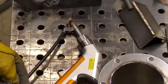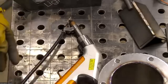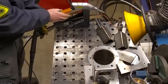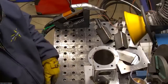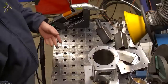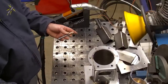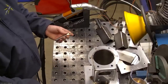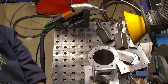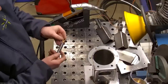Well, then when your tip wears out, you'll know it because it'll stop welding. Yeah, that's the theory, but in reality, I've never had one wear out enough to do that. Apparently, from what I'm told by some people at the manufacturer, stainless and mild steel can be up to about 4 millimeters out of focus before your welds are not going to work well. So imagine wearing this down almost 3/16 of an inch, that's a lot of wear. I've never had one wear that much, unless I damaged it, like I dropped it and dented it to the point where I had to grind it off.